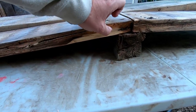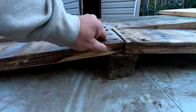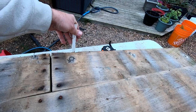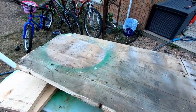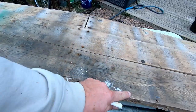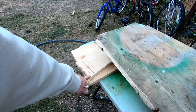I've got a 4x4 that's a little chewed up and messed up right here, so I'm going to end up popping this off and trimming it down — because that's going to be a problem when you're leaning on the bench working. I've measured in six inches all the way along and I'm going to cut that off so I have a nice edge. Then I'm just going to round it over so it's not a sharp edge, and then we're going to put the end pieces on. It's going to tie it all together.